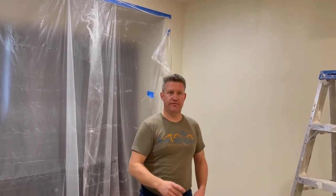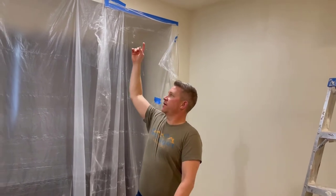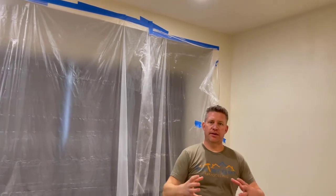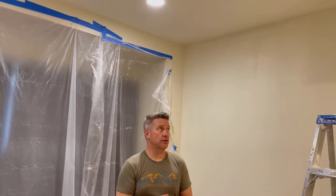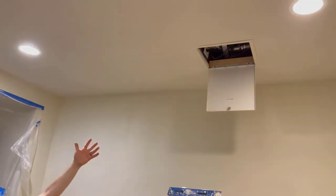In this case you probably have about 60 feet, because it comes from the dryer, bends around here, goes here, and then goes out of the house. This customer had a lot of moisture in their vent — it was leaking at the elbows and in the bathroom, and that's why we got the call. We put an access panel here and installed the LB2.